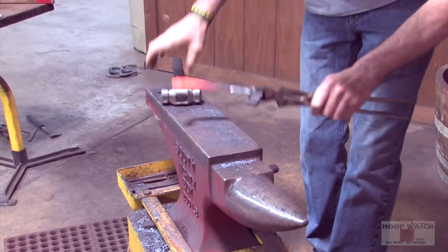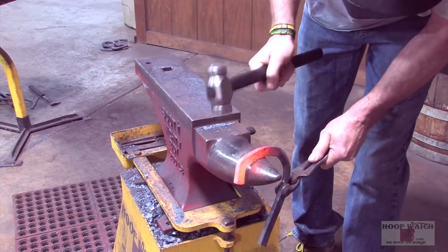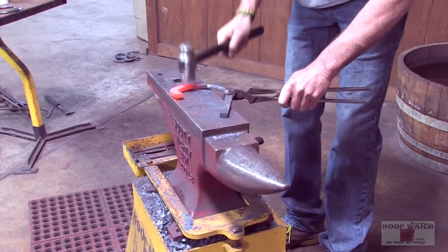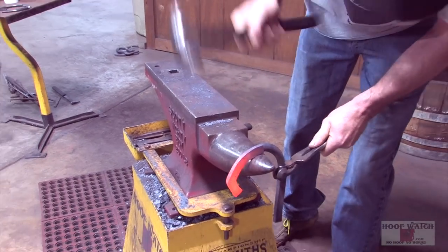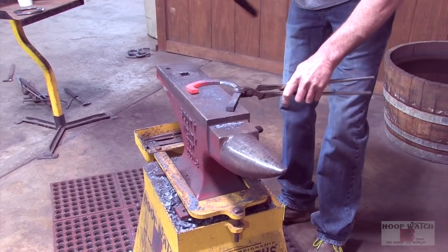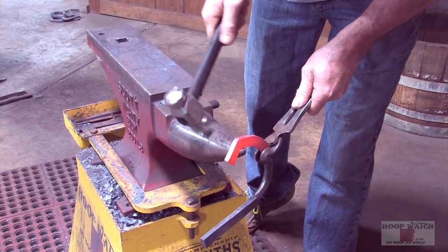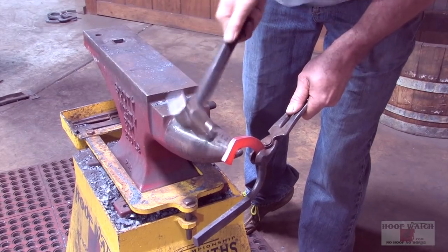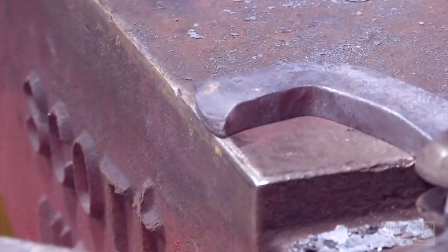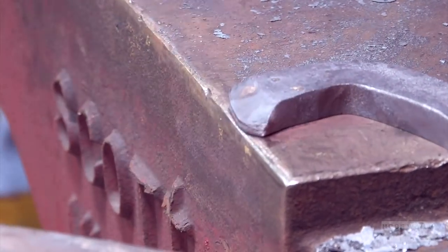I got most of the heat down here, so keep it bent down there, because it will want to kink in the toe, because your toe is gone. Take a nice smooth round and just kind of push that invertedness into your bar. There we go. Take a soft edge and scarf it down.